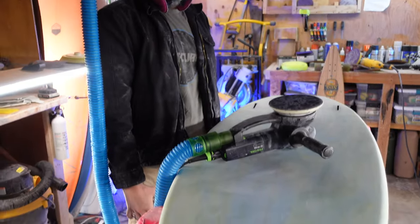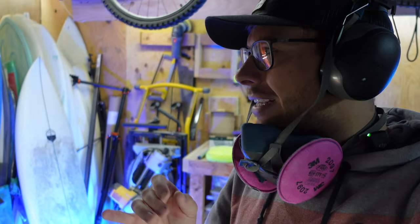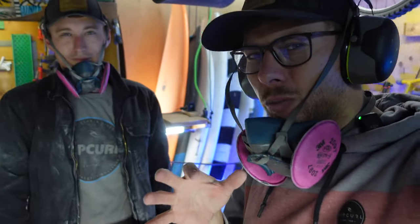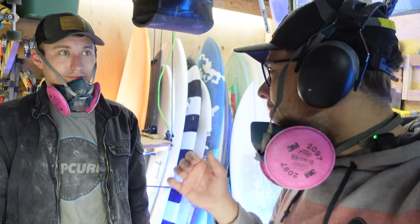Normally I start with 80 grit or 120 grit. But the layer was so sticky, we were gumming up so much sandpaper that we jumped to 45 grit on random orbital mode, and that seemed to do a really good job of ripping off that sticky, weird wax layer. If anyone knows why that happens, maybe if it was caused by glassing when it was really cold out, comment below, I'd be really interested. So, normally start at 120 grit, today we started at 45 to get that off, now we're gonna buff it with 80 grit, 120, 220, 320, and then that'll be it.